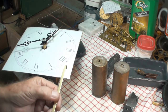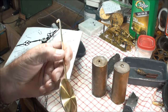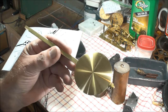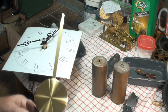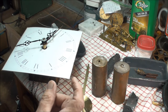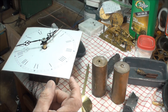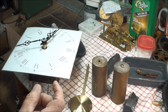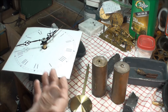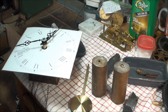Comes to a pendulum. I was just using this here pendulum. This here goes to a battery-powered clock. It seemed to work, but like I say, I haven't tested it to see how well the time works with the weight or the pendulum. You could get those pendulums that have the smaller brass, I do believe it is, that are adjustable, and it already has its wire going up, and start testing that so you can get your length, and also to make sure that the weight that you put on the clock will run the clock with the pendulum you stick on there.